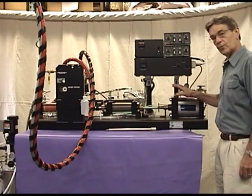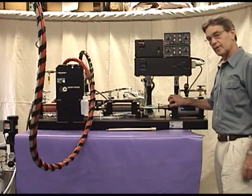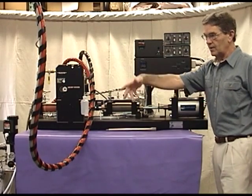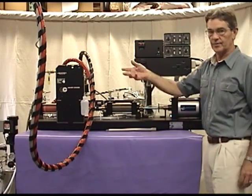The flow is controlled with the air cylinder on this end. By increasing the pressure on the drive cylinder, you increase the pressure on the fluid, which increases the output at the mixer. By decreasing that pressure, it slows the system down and decreases the output at the mixer.